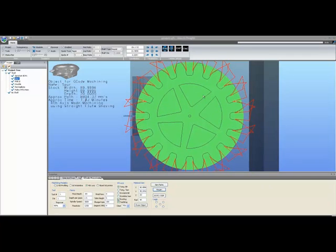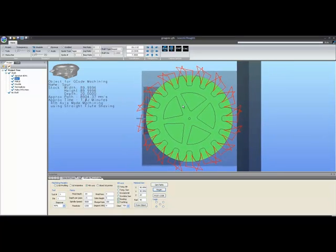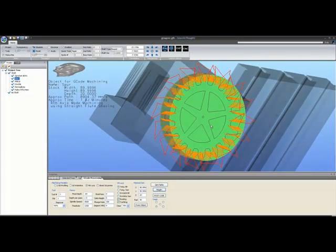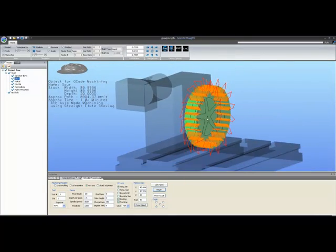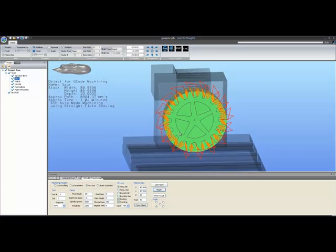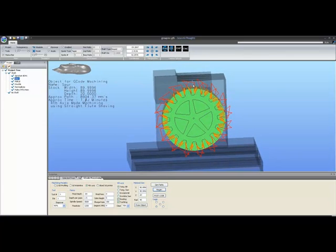Now this is where it becomes important that you understand a little bit about tangential machining and about how I'm displaying this toolpath. 4th axis toolpaths are very hard to display. Typically, if I was to display them for you exactly what was going to happen, what you would see on a typical XY system is simply the tool running straight back and forth in the X while the rotary rotates. This means that all the motions, all the toolpath display would be up here at the top, and it would just be a mess of lines and arcs, and you wouldn't be able to tell what's going on.